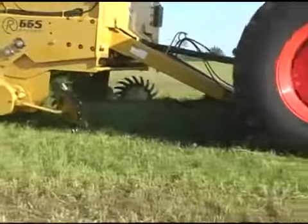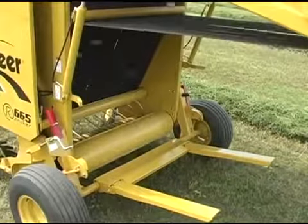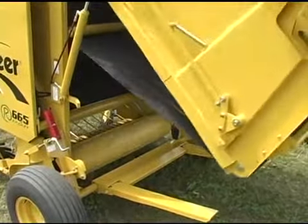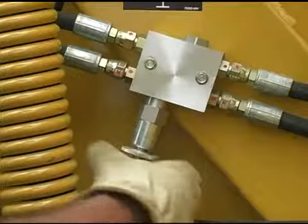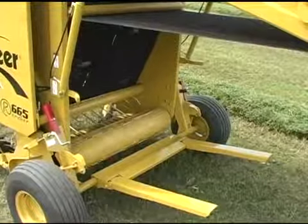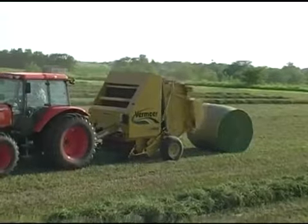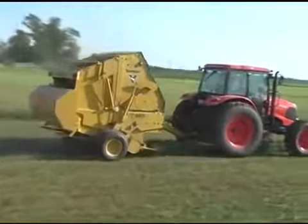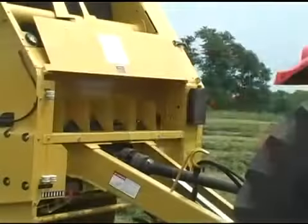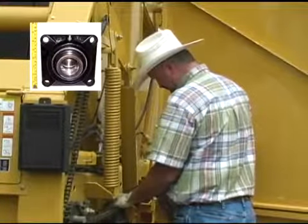Also, check out the way this machine is built. You have a heavy-duty reinforced five-bar pickup with a big open throat, bottom drum design, and heavy-duty steel drive rollers to turn the bale and help maintain belt tension. Hardened belt guides keep the belts in line. And with just a single hydraulic control, you can easily adjust bale density. Clean, separated belt design reduces potential buildup. Drop-and-go bale ejection eliminates the need to disengage and re-engage the PTO when dropping a bale. And the robust center pivot electric twine tie system, which is standard, comes with dual slot feed. It's easy to thread, easy to maintain, with plenty of storage for extra balls of twine. Also typical with Vermeer quality construction: heavy-duty shaft and bearing combinations, which help maximize wearability and chain sprocket life.